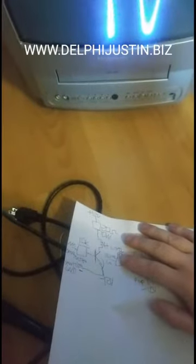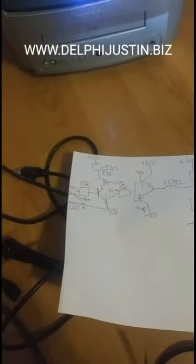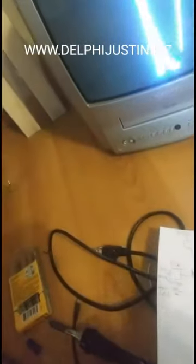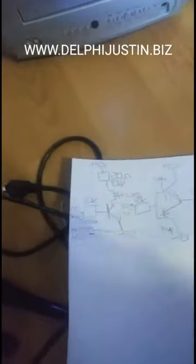I haven't ordered it yet - it's coming in sometime soon. What it'll do is create the signal. I actually call this an amplifier, but basically why they call it an amplifier - it's not going to come out the same voltage as the input. You can put in 20 volts and it won't come out 20 volts because the collectors are at plus and minus 12.